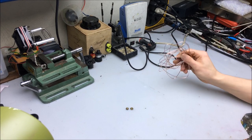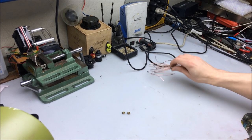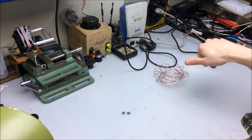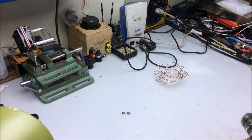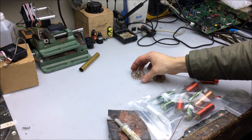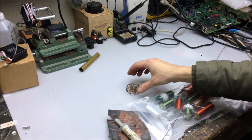We have this little copper wire here and we have these two brass nuts. What we're going to be doing is wrapping the copper wire around a cylinder and then folding it over like a donut, so it's going to end up being a little tiny top load for small Tesla coils. We're going to be showing you how to wrap your own custom tiny Tesla coil top load using copper wire and a brass nut.